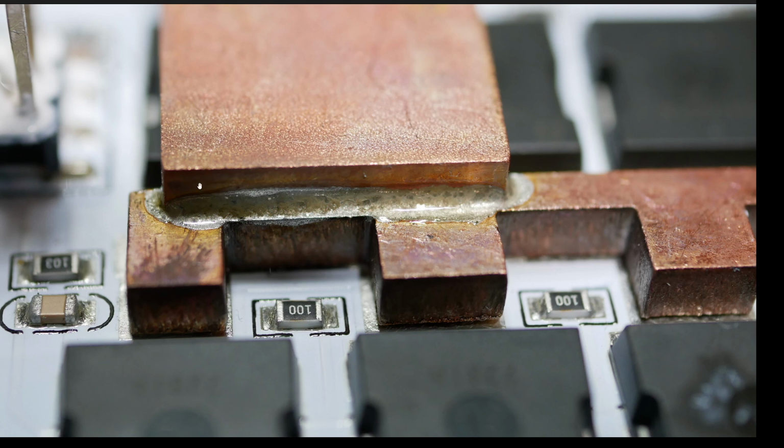This is actually a pretty decent solder joint. So you can see how the solder flows from the comb up the face of the bar. That's the bridge. So I like seeing things like that. That's a fairly decent solder joint. That's probably going to hold up pretty well. But cracks don't self-heal. This is only going to get worse. Exactly how long it will take before this piece of copper completely lifts off of the trace underneath it, I can't really say, but I don't expect it to be very long. So yeah, that's absolutely flat out got to get fixed.